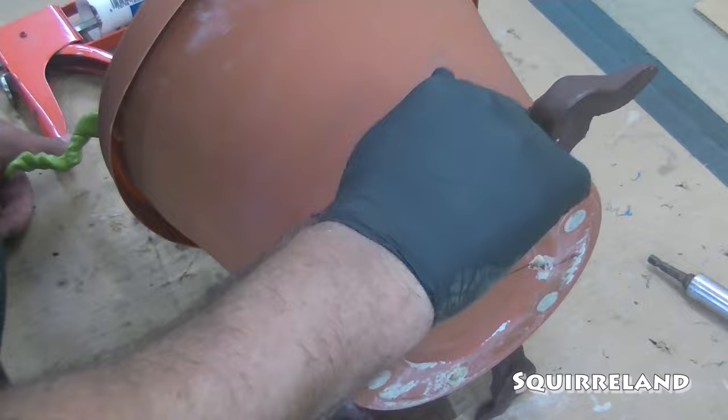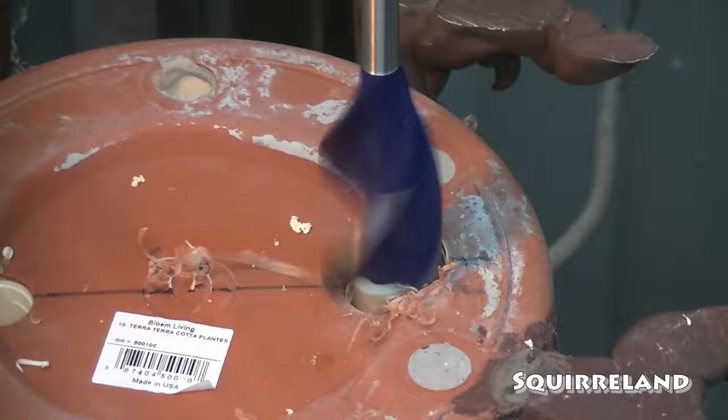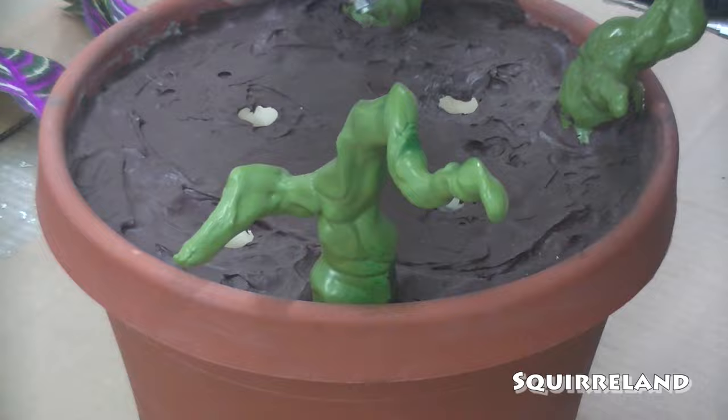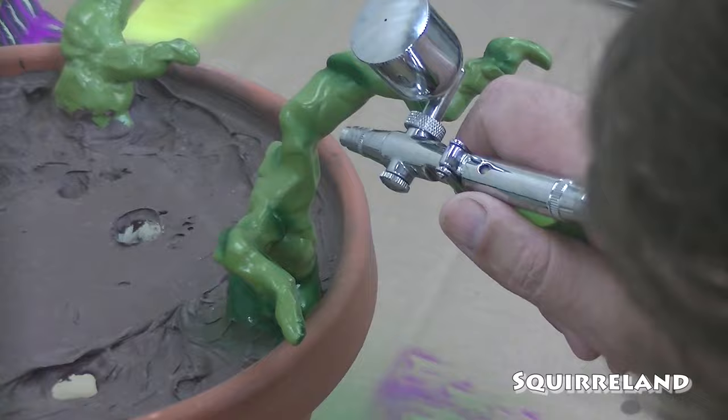Next, I need to drill out some recesses on the bottom of the base, under the holes that connect to the pieces of PVC that are attached to the strip of wood. The reason that I'm doing this is because I need to make room for threads, washers, and bolt nuts. The way that the base and stem will attach together is with pieces of all thread and some bolt nuts. This way, when everything is assembled, it is very securely fastened together.